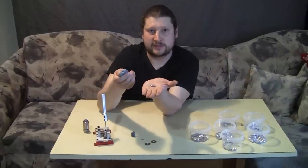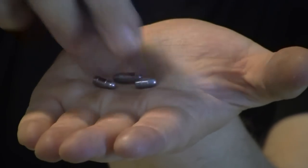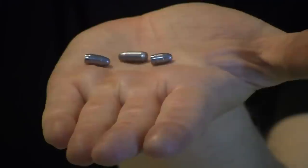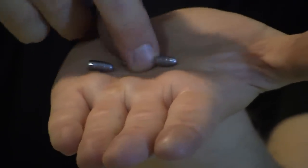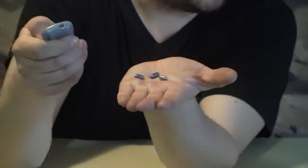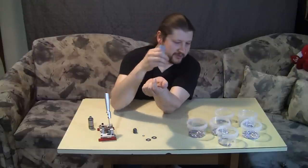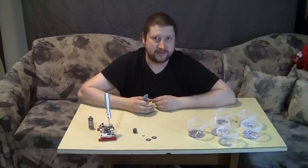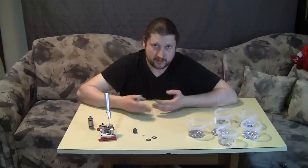Let's take a close look at these slugs. This is the standard one — you can clearly see the biggest one in the middle. This one is 44 grain, this is 36 grain, and this is 52 grain. The 52 grain is really a beast — a long bullet. I'm actually taking advantage of this swaging die more than it was designed for, and I quite like it because I have options to play around with weights and lengths. The shape is always the same — round nose front and boat tail rear — but the body can be different lengths.